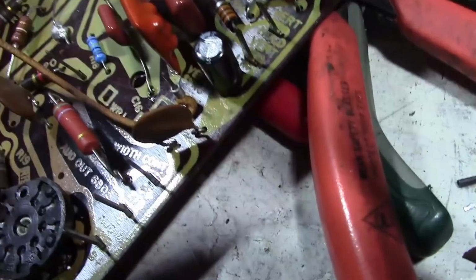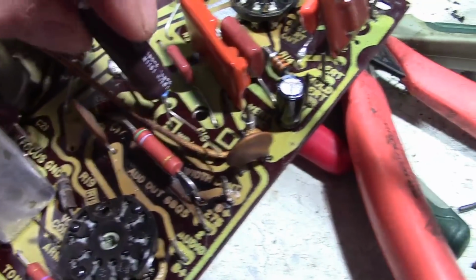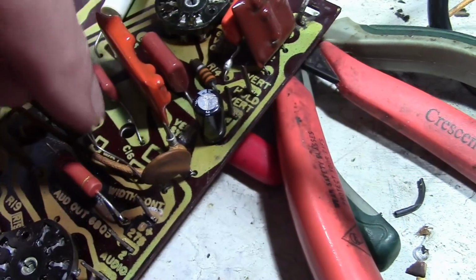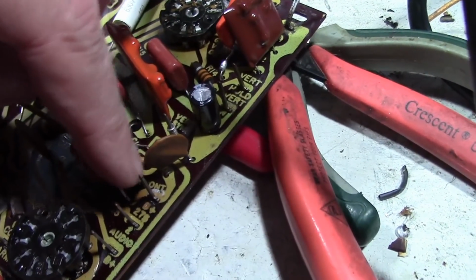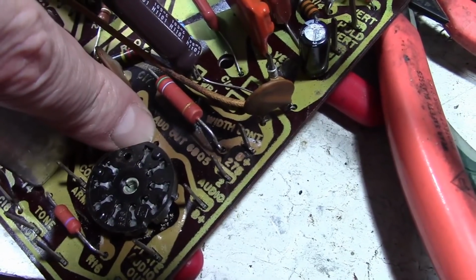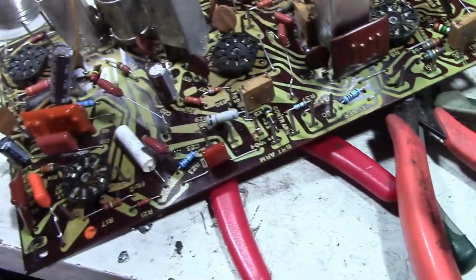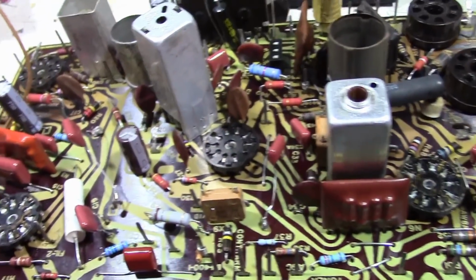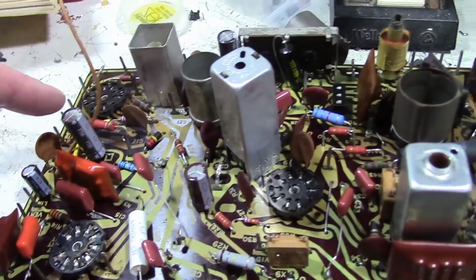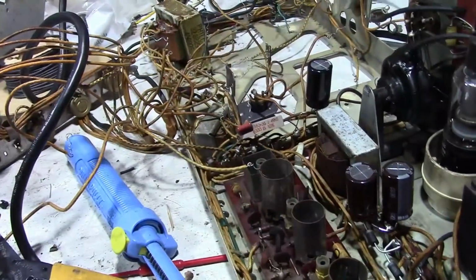but nothing else. So what we can do is take our capacitor and go from like this, so the grounded side goes in this hole, put another one in one of these 2 holes, and then take the other hole and run a wire from here, and I'll just jam it in here next to the resistor. Put 2 leads into one hole, and that's that, which leaves one last cap. Alright, so we took care of 1, 2, 3, 4. We got 5, 6, 7. There's one more left.